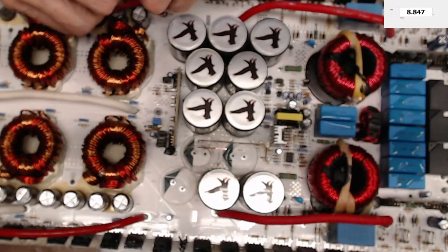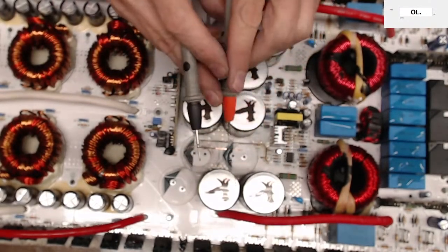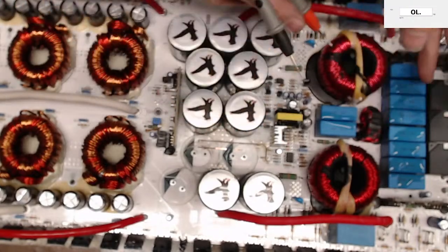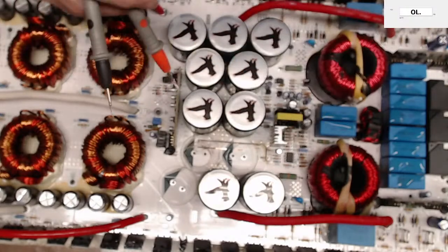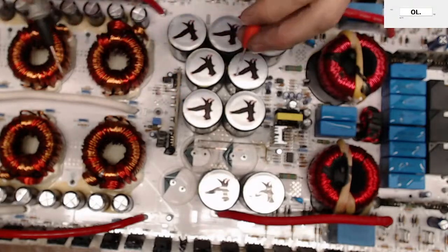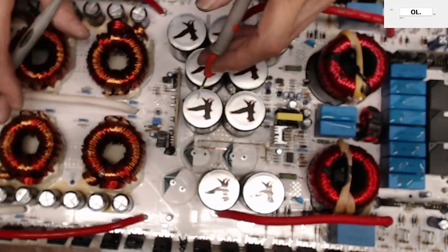So I'm thinking that this amplifier was just a failure of the capacitor wearing through and shorting out the positive and negative rail at the capacitor. So it really wouldn't affect the output. I'm surprised. I guess that was a really quick short because these traces are so small and thin. If the traces were much bigger, I think it would have overloaded the power supply and then taken out the power supply.